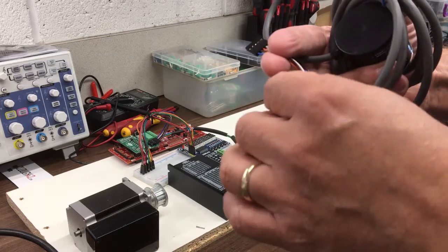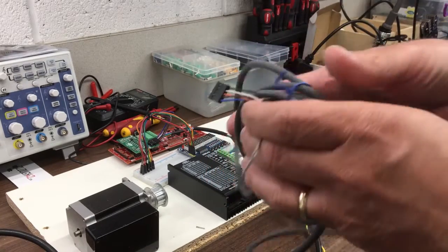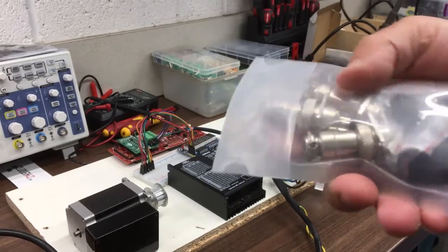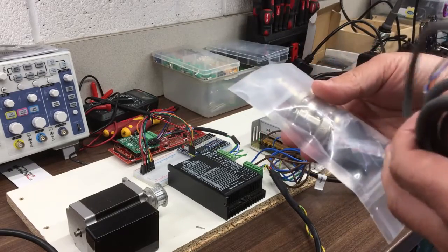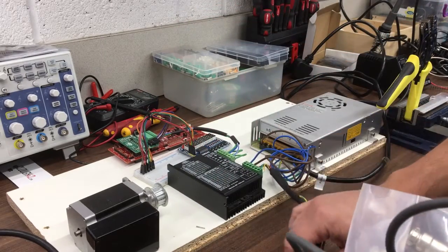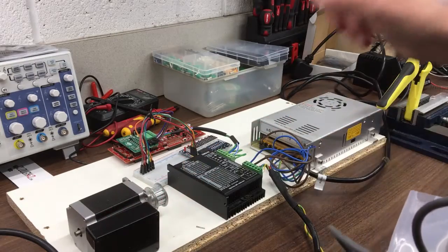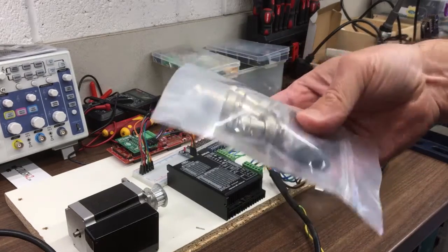I won't use the screen at the moment, but in the final install I'll screen that down to earth. A number of these cables will pass through the main box via the control panel with a connector. I'm going to use GX16 connectors — deliberately with different pin counts: three, five, and six pin — so you couldn't plug them in incorrectly. One for the encoder, one for the stepper or servo driver pass-through, and one spliced into the display cable. So the display, servo, and encoder all plug into the box separately.